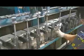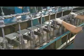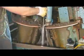Automated injectors fill it with oil that's specially designed to maintain its consistency despite changes in temperature. Next comes the head assembly, which includes the steel piston rod and the mount on the other end of the shock absorber. Two copper welding wheels fuse the head assembly to the base assembly with a cap, closing the unit and sealing the oil inside.